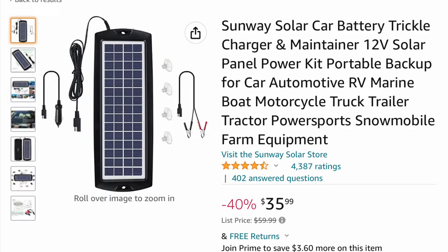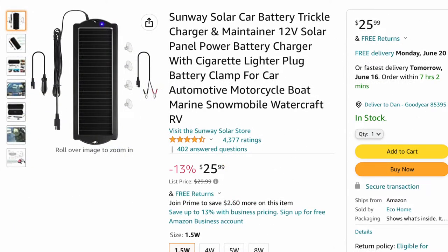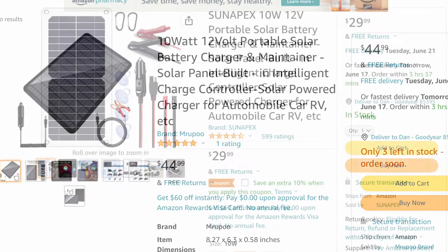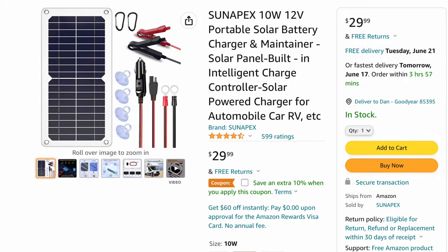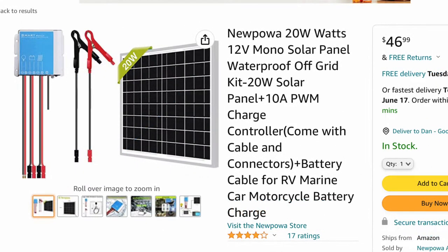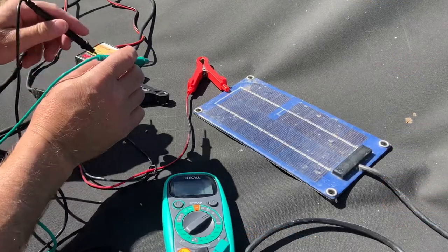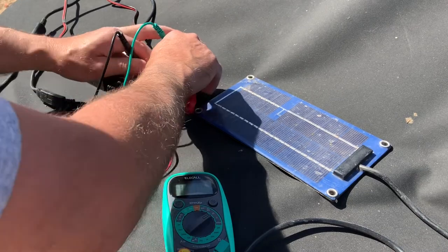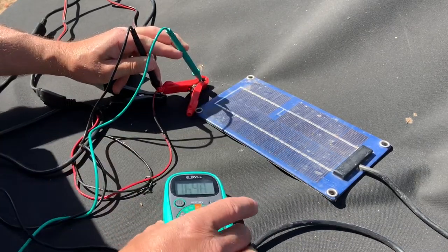One of the first major differences between solar panels is whether or not they come with a controller. Most likely the smaller ones under 10 watts probably are not going to come with a controller, because with less than 10 watts you're never really going to have a chance of overcharging a battery. When you start looking into solar panels pushing 10 watts or more, most likely they will come with a controller that keeps the battery from possibly overcharging. I don't like to see it climb above 14.6 volts. If you test these solar panels before hooking them to a battery, you might see voltages pushing close to 20 volts, maybe even a little more, and that is considered normal.